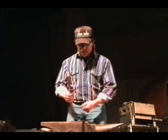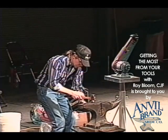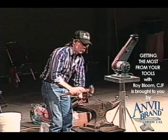Loose grip. The same thing's going to occur with your tongs. You want to try to keep that work right in the center too, so that you're hitting right in the center. You have control. You can see it right in the middle.